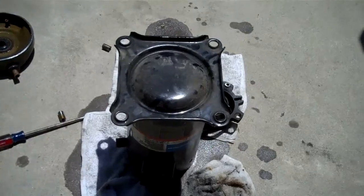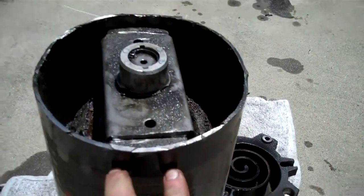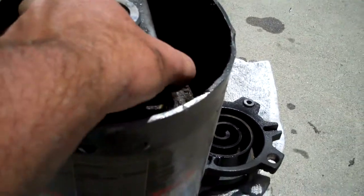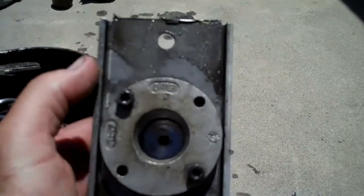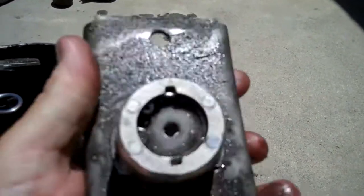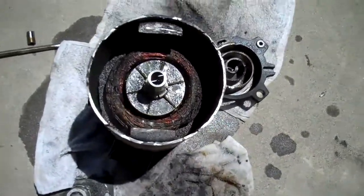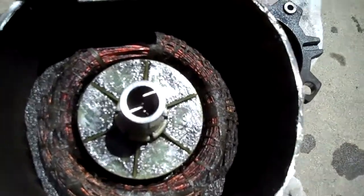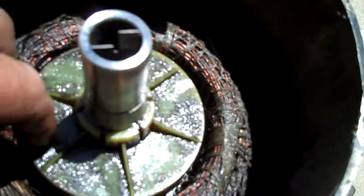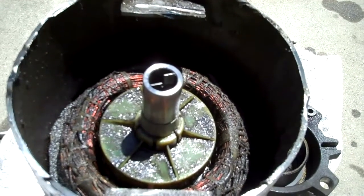You're looking at the bottom of the compressor. Take off the top — there's your center support with two welds here, two on the other side. Take that off and you've got this piece, with two allen bolts on the bottom to hold the piece onto the center support. There's a little washer on the bottom held on by a snap ring. This is your shaft. These holes are probably for the oil — the shaft's hollow all the way through. This plastic piece has something to do with the oil; there's a hole in the side of the shaft where it gets oil, probably feeding it down inside the bearings. I'm not going to pretend to know exactly how it works, so I'll just show it to you.